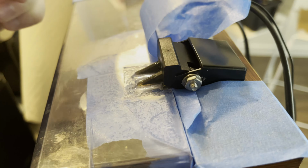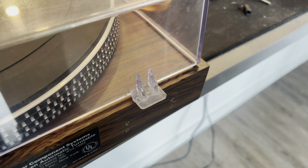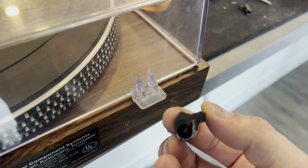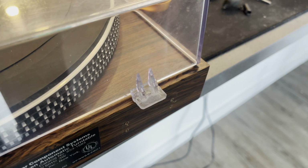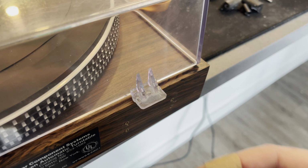So yeah, it doesn't look too bad, I guess. And then another issue I ran into is because I printed it on the resin printer, I didn't realize how brittle that resin is, and it kept just exploding these. When I would lean it forward, they would just crack apart. So that was one broken one. Here's another broken one, and they all failed in the same spot. Just too much upward force on that.